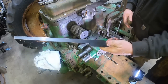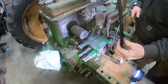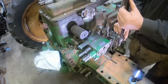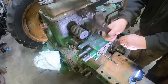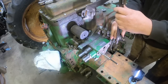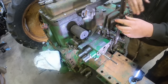The last lever is different than the others. You can go up to 4 valves on these. The outside 2 are the same. They're kind of hard to come by. The 3rd and 4th valve levers, well, I guess everything used to be a current part at one time, but when I put the 3rd valve on the 2255, they were still a good part number at AGCO, but they have since discontinued it.